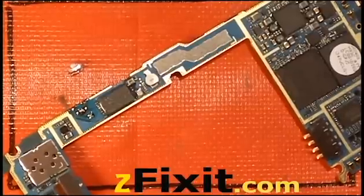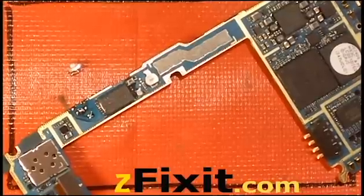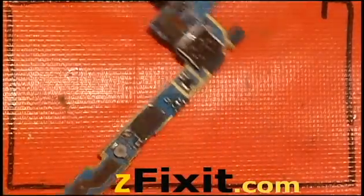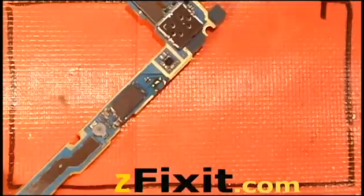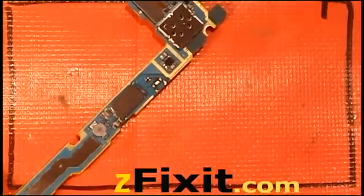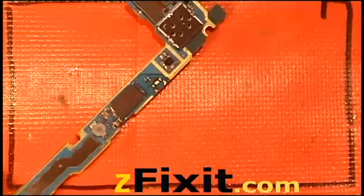The next step is to remove the low melt solder from the solder pads. Use copper braid — cut off any old braid that you have already used and make sure you use fresh braid. You might want to put more flux on the solder pads just to make it easier to flow into the braid. I believe there's enough flux still on here.